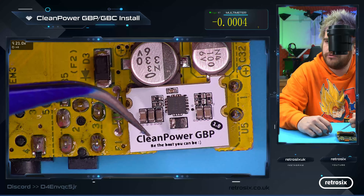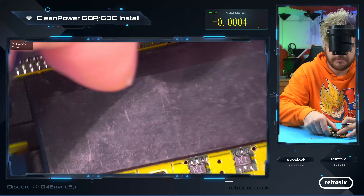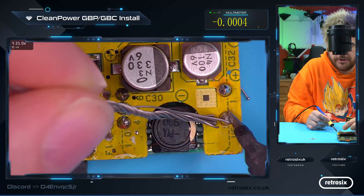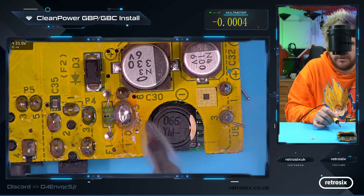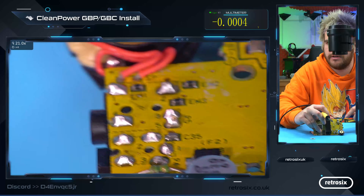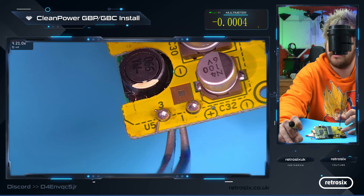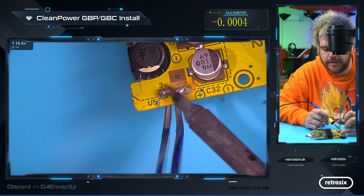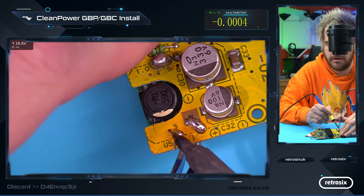For this example, I'm going to show you how to remove the old regulator and then install the Clean Power. We have the original screen here, so the screen won't show but we will hear the audio. The simplest way to remove the regulator without any fancy tools is to apply plenty of solder — just get fresh solder on the pads you want to remove, these three and the other two. You can happily bridge them together because it's coming out — that's just going to help with heat transfer. Get tweezers under here, wedge them in, and apply some gentle force. Then as you warm up the two pads simultaneously, apply a slight bit of force on the tweezers and you'll find it will start to come loose.